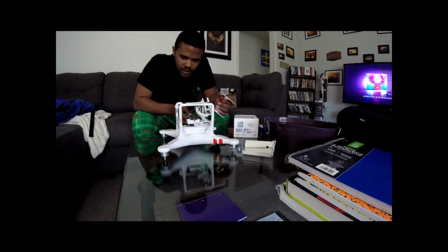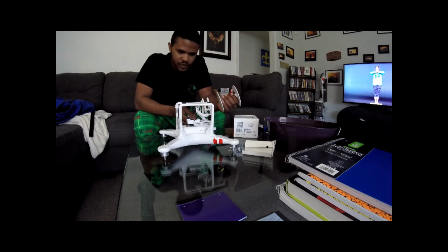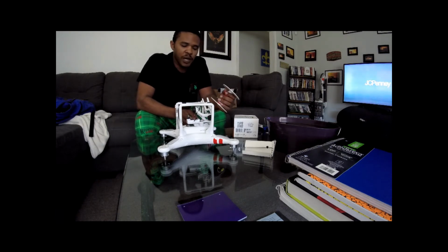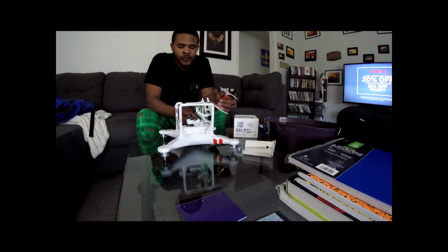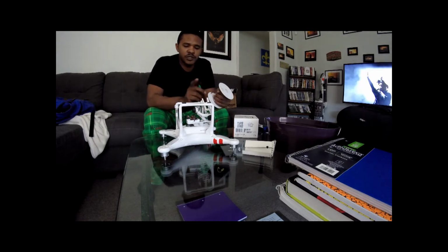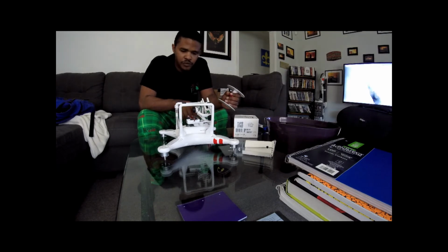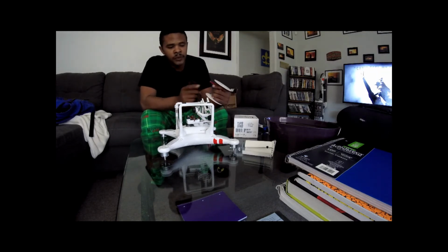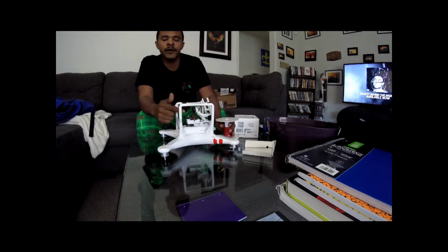So it looks like I used probably 4 inches maybe, and that was probably just a little too much, but I wanted to make sure it didn't get yanked around too much. So just like I said, you go ahead and shave off on all 4 ends of the wires, or really it'll be 1, 2, 3, 4, 5, 6, 7, 8 ends, and you put the heat shrink wraps on, and you can go ahead and extend your wire.